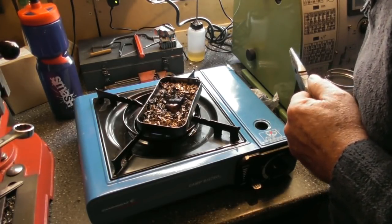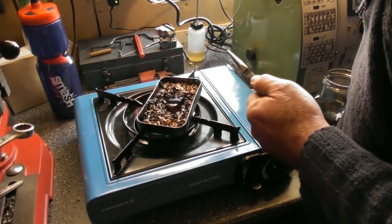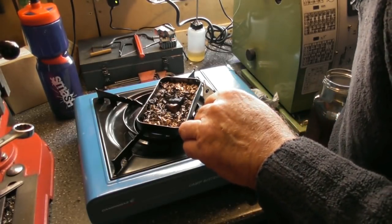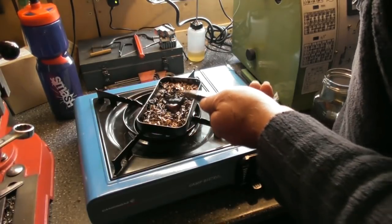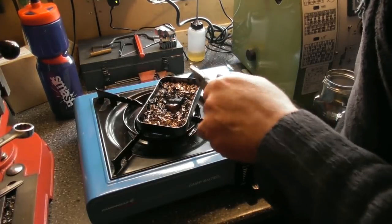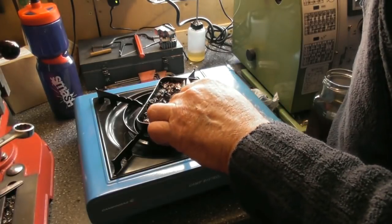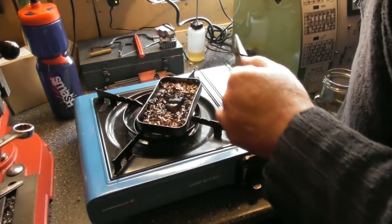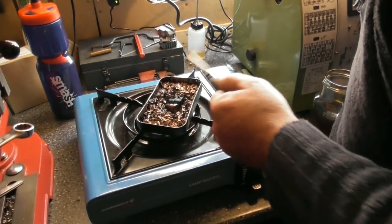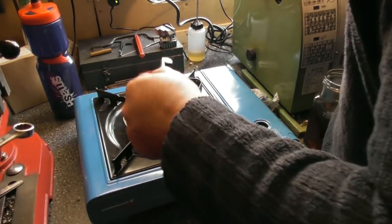It's still a little bit purple. I don't know what it goes after blue — I think it just goes black, or it actually goes back to silver again if you go too far. I've used bluing and pale straw for heat treating scribers and odd punches, but I've never tried to do a complete component to a colour. And it's not for the heat treatment version — it's purely for the aesthetics and the fact that it will offer some rust resistance. I'm going to pull that out.